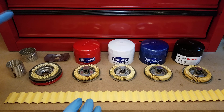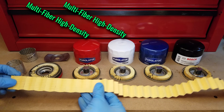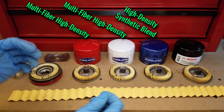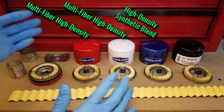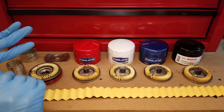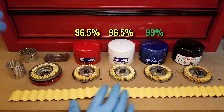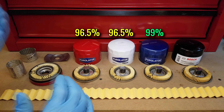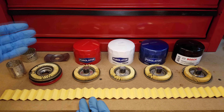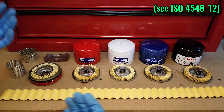The Classic and the Tech both use the same multi-fiber high-density media, whereas the One uses an upgraded high-density synthetic blend media — and that kind of explains where the efficiency numbers come from. Purolator does publish efficiency numbers: for the Classic and the Tech you get 96.5%, and for the One you get 99%. I had to email Purolator to confirm they got these efficiency numbers through ISO standardized testing, which I wish they would just be upfront about on their website.